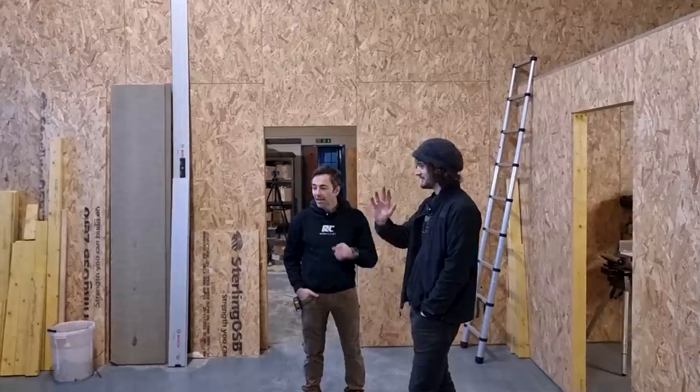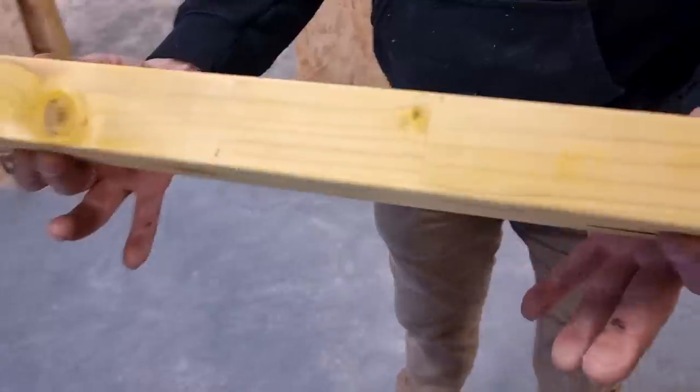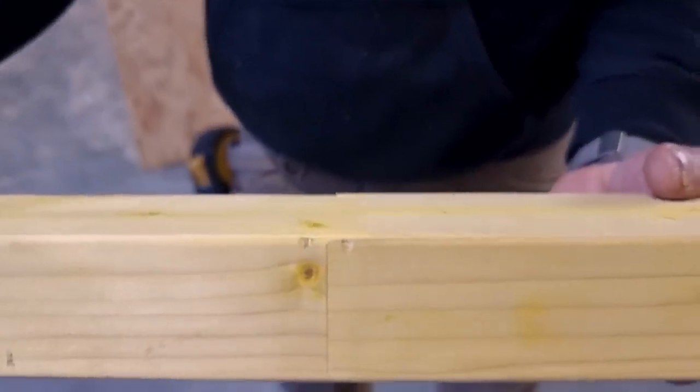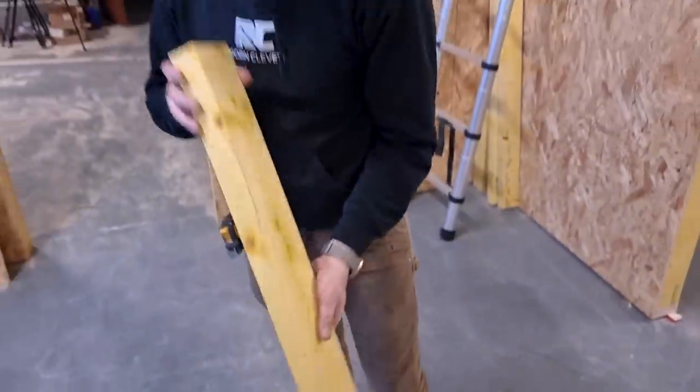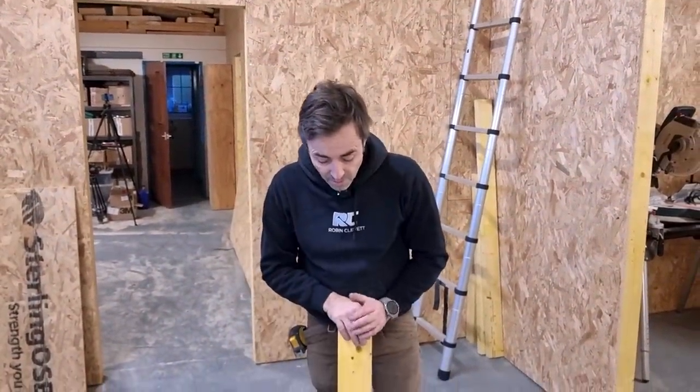And the other thing is the True Stud. You can clearly see the difference it made in terms of workflow and speed — you've just not been sorting through timbers and all that sort of stuff. It's dead straight. It's more expensive, but you could go on the internet and search for structural timber, four by two, 100 by 50, and find it at a price — but chances are it's not going to be brilliant. Whereas True Stud has a fantastic moisture content — the levels are about 14 to 16% and they'll never change, they'll always stay like that. It's super straight because they engineer it. Each length is made up of many other lengths joined together, so instead of long lengths where softwood goes all over the place by nature, bending and bowing and cupping, this isn't going to do that at all.